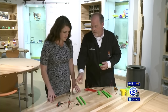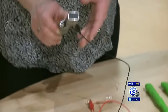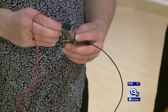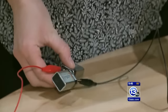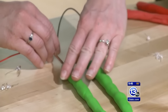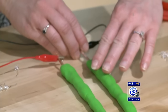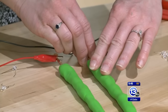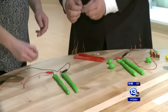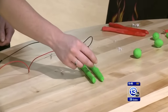Here's what we're going to do. I've got two 9-volt batteries snapped together — that's an 18-volt battery. Take those copper nails and spike them into the ends of the Play-Doh wires, like I've done on mine. This applies a voltage to those two Play-Doh wires. We've got some little LED lights with the legs spread apart — go ahead and bridge the two wires with an LED and see if we can get it to light up.